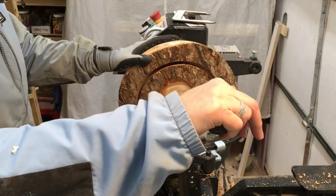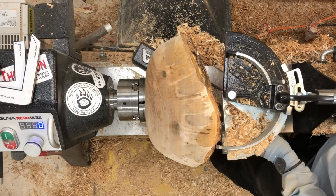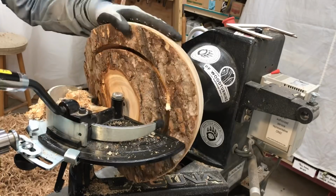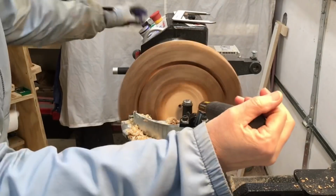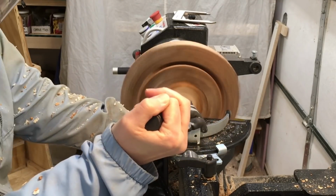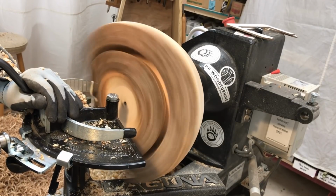There wasn't any damage to the mortise. It didn't break it out or crack it or anything, so I'm assuming that it's just maybe a little bit shallow a mortise for this size bowl, and then also for the torque involved in coring it. So here's hoping it'll hold long enough to get at least one bowl out of the center.